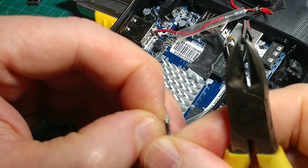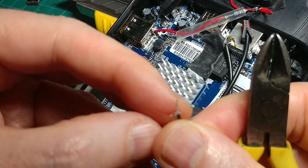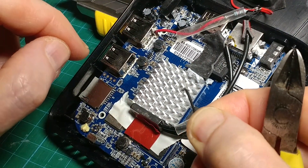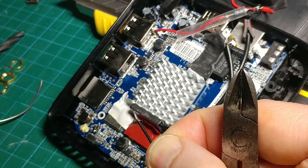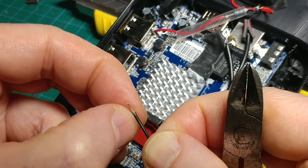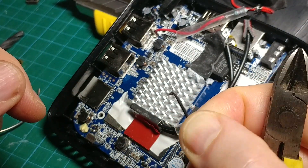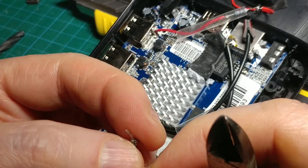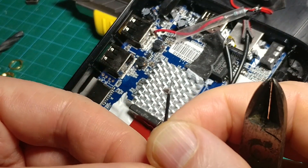It's even easier if I cut that bit off the inside. It's getting there now — I've got all the screen folded back and the center pulled up. So you've got a central core with a bare end and the screen coming off the side. I'll try and tidy that up. So like that — the screen is going to go to the side, and the center part is going to solder in there. I'll just pre-tin it and tidy it up a little bit.